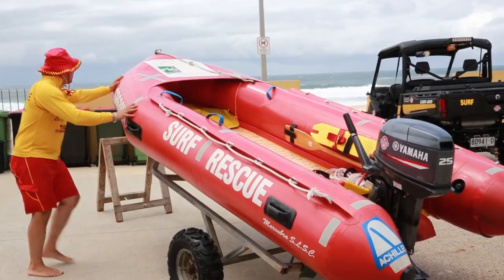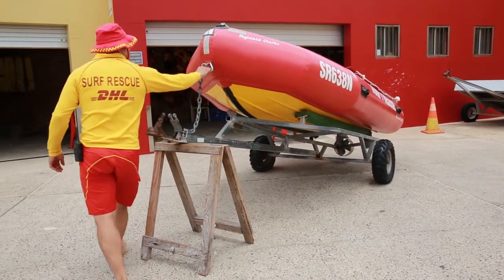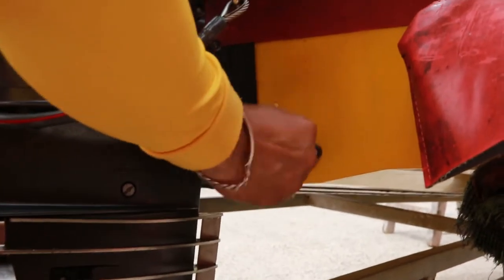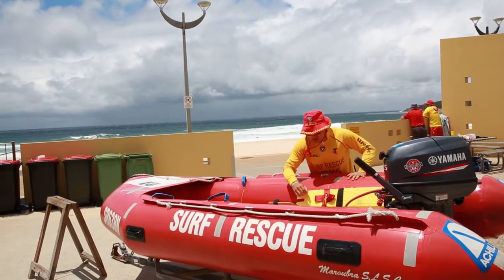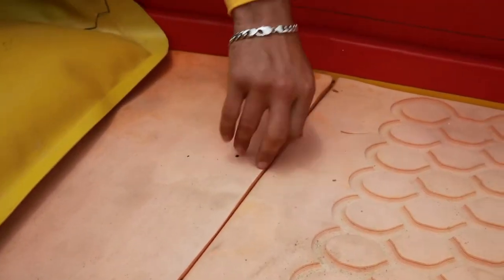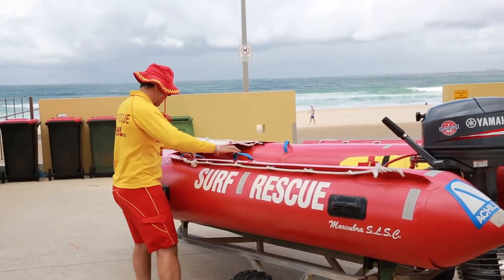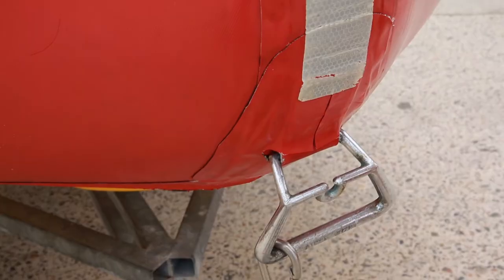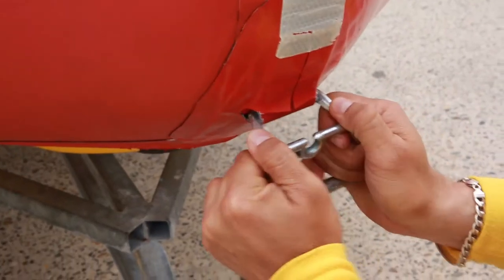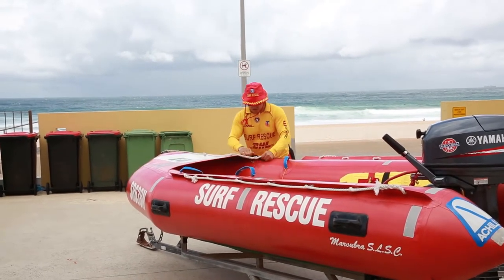As part of a pre-launch safety inspection, a crew person can visually inspect the hull for wear and tear and ensure that any drain holes are plugged securely with a bung. The floor of the boat needs to be well secured and anchored to the hull. The handles, foot straps, ropes and fastening points can be checked to make sure they are well secured, functioning properly and don't have any frayed or sharp edges that could cut people.